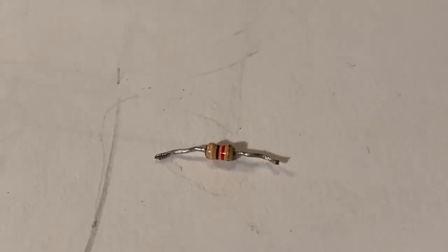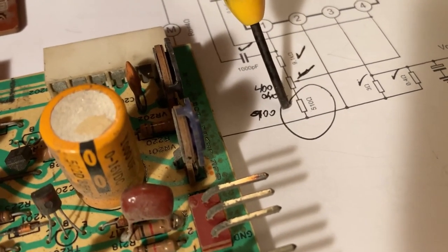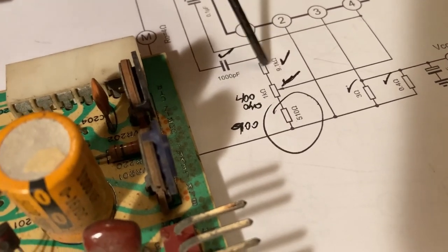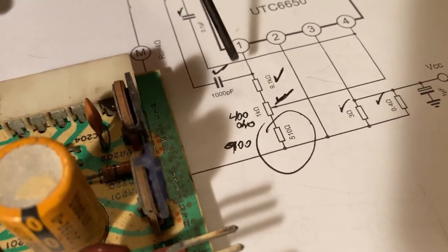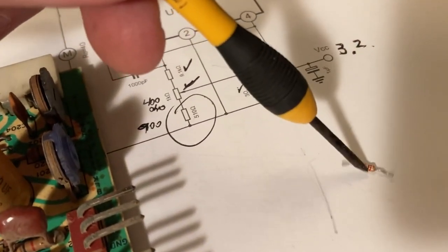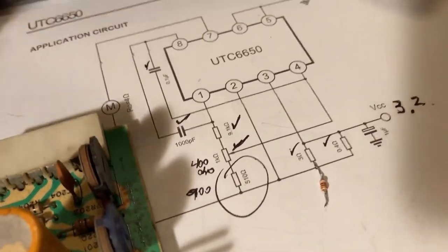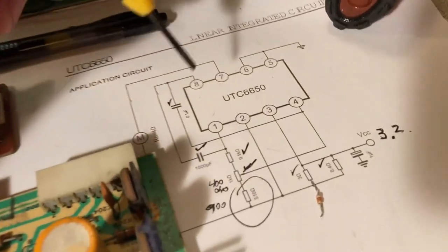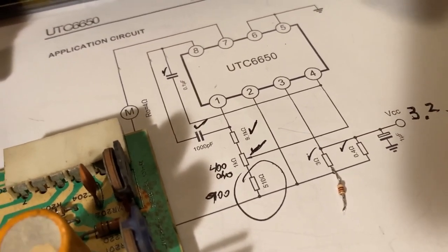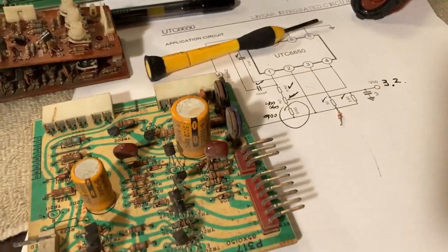So yes, this one is different. But if I short across this one, it actually slows down. This one is correct — 9.1K. If I short this out to where it's gone, it gets really fast. So I think I'm going to do the same thing but with a 4.7K instead of 9K. I don't have the schematics for this actual radio, but the shortcut fixes it, so that's what we're going to do. I'm going to lower this resistor, which should fix it. Let me see if I can find something like 4.7K and put it in there.